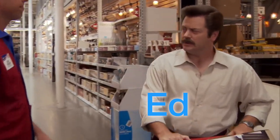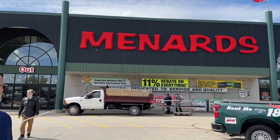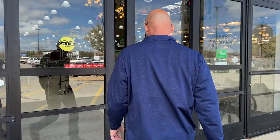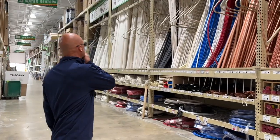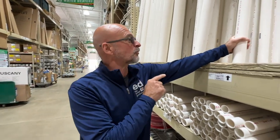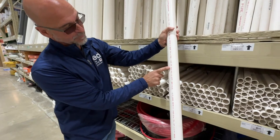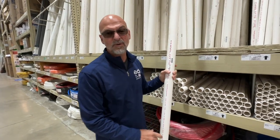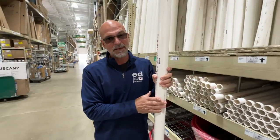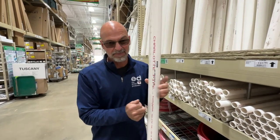Let's go check out our local home improvement stores and see what they have to offer, and then we can start our test. So what we want to make sure of — I want to go with at least 200 psi or greater for our application. Schedule 40, so it's 280 psi. The 200 psi stuff is a little bit less expensive. What you want to be careful of though is drainage pipe — it has a thinner wall, so it may not be able to handle the abuse that we're going to be talking about. So let's get a few sticks of this.